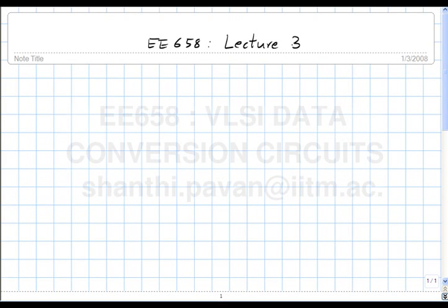There are really, really high end scopes which have bandwidths of the order of several tens of gigahertz, and it is often not possible to build sample and hold circuits which are able to sample at those speeds. However, you might be able to build a sample and hold which samples at, say, 1/10 the speed, in which case you put 10 of these together, each one working at 1/10 the speed, and then you look at the sampled output sequences of each of these slow sample and holds, and presumably you can put them together so as to get an equivalent sampling rate of 10 gigahertz or 20 gigahertz or whatever it is, okay.